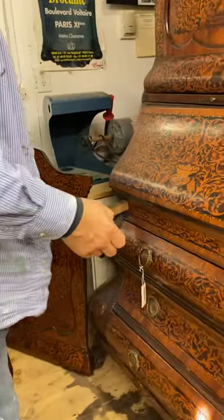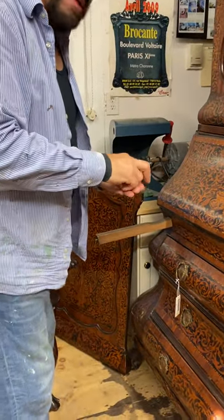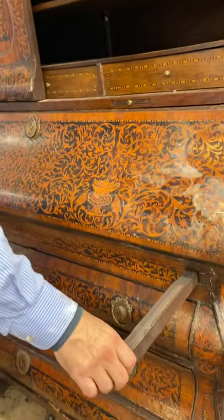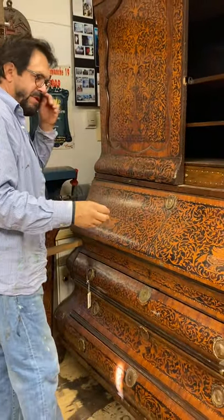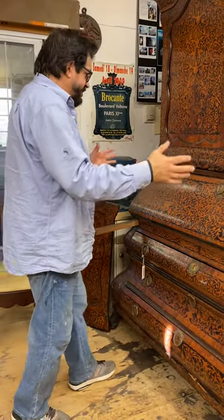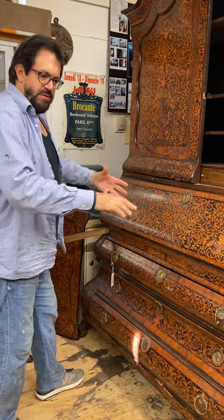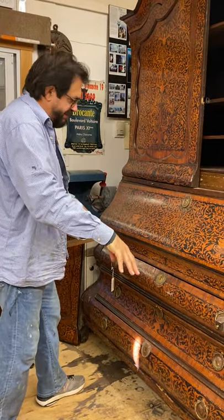Let's take a look on the inside. Here are your lopers — you can always pull your lopers out. Always repairing stuff from people that don't deal with the lopers. Let's put this piece of marquetry up here so we don't lose it. The lopers are your lid support. The width, breadth, and weight of this piece causes it to rack. So if anybody wants to move this piece and set it down, the flap doesn't work, the drawers don't work. You need to shim and get the superstructure to move just an iota, crossing the diagonals of its landing pattern on its feet.